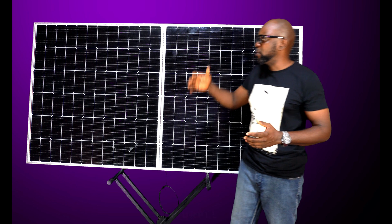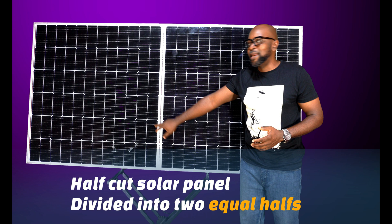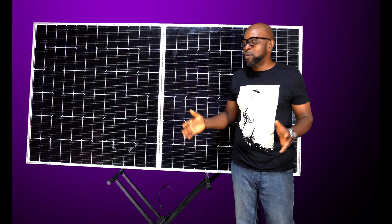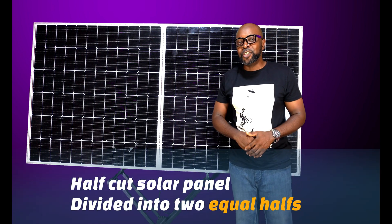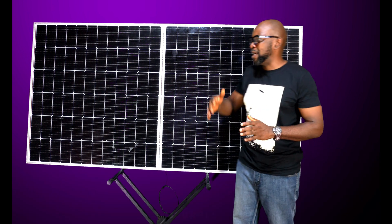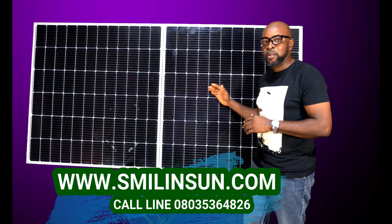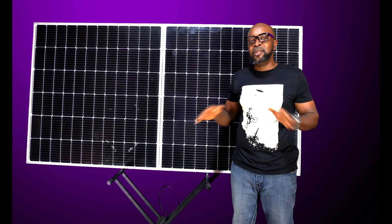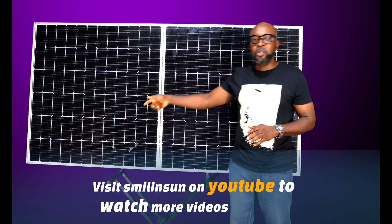What's interesting to note is that the solar panel is now clearly divided into two — you can see the white line clearly dividing the solar panel into two equal halves. You might wonder why it's divided into two. This is essentially done to address the issue of shading, which has been plaguing solar panels for years — situations where particular cells are blocked off when you have leaves overhead, which drags down the entire output.